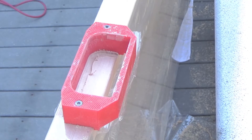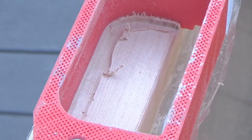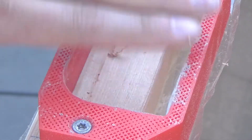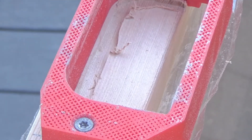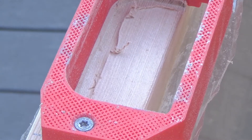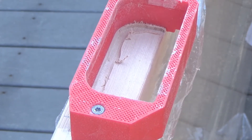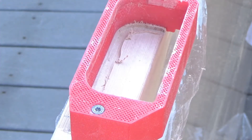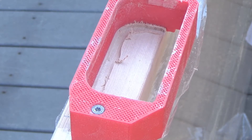That gives us our initial slot and radius that we're looking for, and now we just simply got to come in with the router — we're still going to use this — and we're just going to kind of zigzag back and forth until the whole profile is finished. It doesn't help that this piece should definitely be a little bit larger for my application because my jig is a little bit longer and kind of overhangs here, but that's not really that big of a deal.